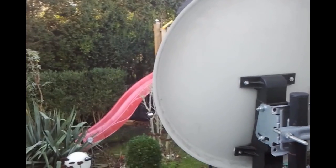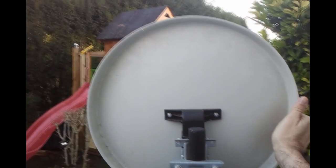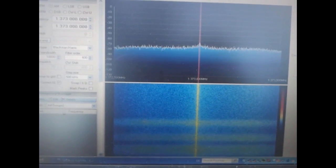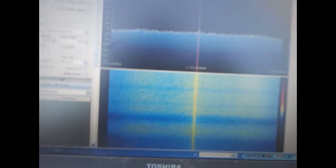So now all we need to do is move the dish around until the signal picks up. I have preset the elevation to an angle corresponding to the satellite I want to receive, so that I only need to change the azimuth left and right. As you move the dish around, you will see there are certain positions where you will pick up an increase in noise. We see it here. Now I pass the point — and here I pass the point. Here is no signal. You can see it in the waterfall as well as in the FFT. Here is probably the sweet spot. Here we are — we have maxed out the signal.